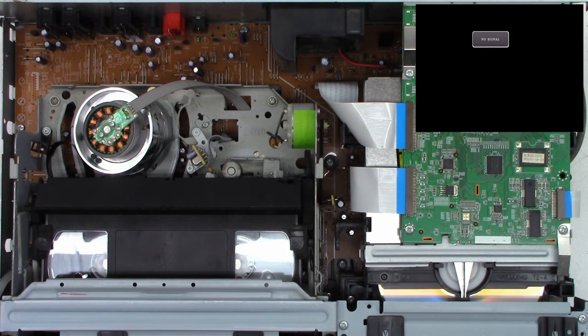And this is going to get down to a fresh coating of the silver plating that they used on these contacts. And it's going to make a mess, and I know that. And people have suggested other scrubbing methods, but I've had extremely good luck using the stainless toothbrush over the years. Like I've said in previous videos, I have some of these units that have been running for 30 plus years. Not these, obviously, because they weren't made 30 years ago, but other units that have been running for 30 plus years after this service on their mode select switches, Hitachis and Panasonics.